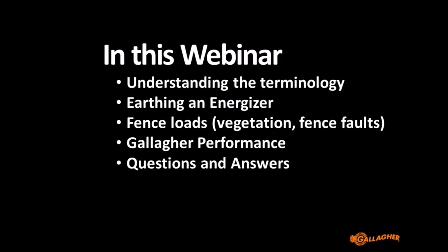So we'll cover those. Then I want to talk specifically about earthing and Energizer, why and how do you know if it's working, and then some discussion on fence loads: what are loads, how is that represented in our Energizer performance, and how do we classify one Energizer against another one. I'll show a performance graph of the M1200i for that comparison, and then at the very end we'll do some Q&A.